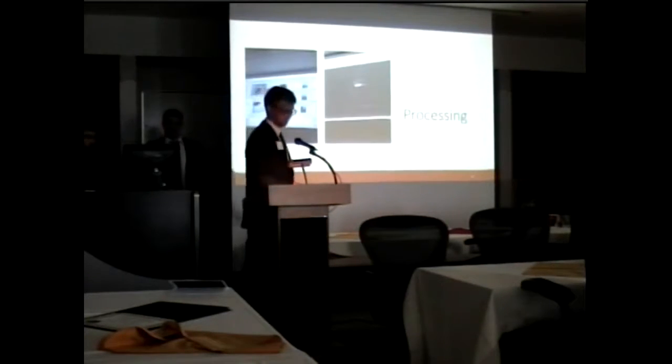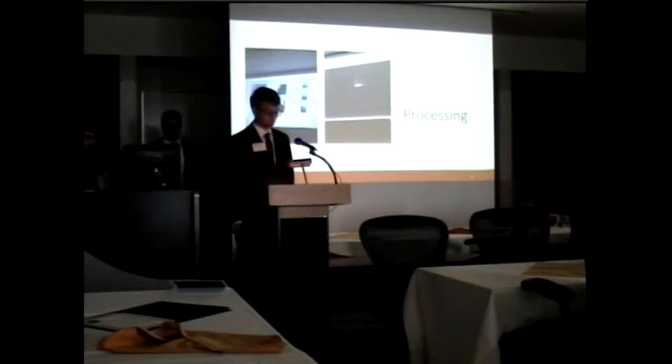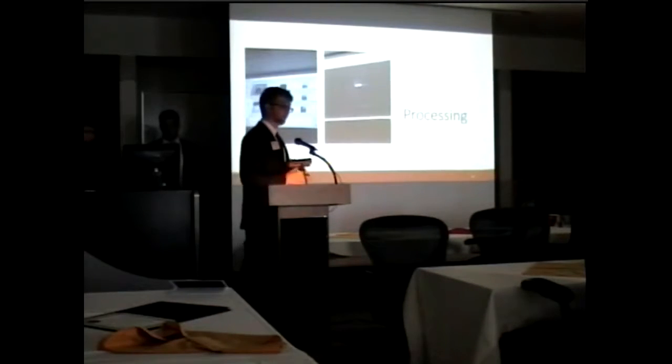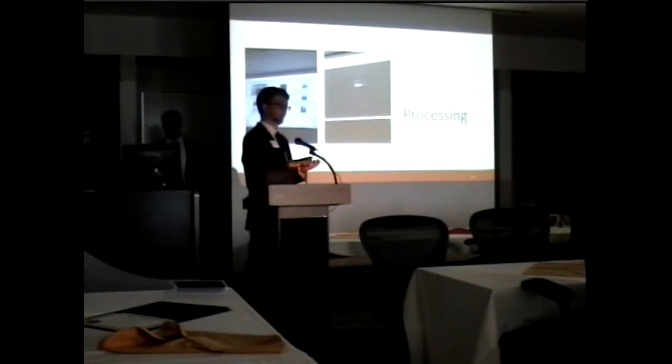In the Riegl software, we import that and put it in RiPrecision, which then takes the actual scan data and the trajectory that the IMU has calibrated out, so that it actually takes the point cloud and puts coordinates on all of them based on the target location.